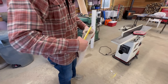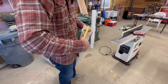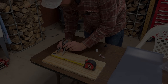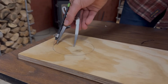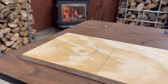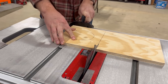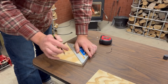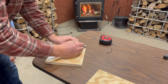We're going to start by measuring the outside diameter of our flex hose, which is about four and three-eighths — we'll call it four and a half inches. Next we're going to mark our piece of wood, remembering to leave room for the magnets, which is what's going to make this the quick connect we're after. We're using our speed square to mark all of our diagonals so we can turn this square into an octagon by cutting off our corners and have all of our angles be even.